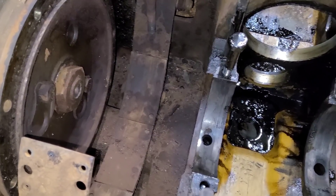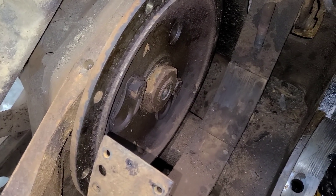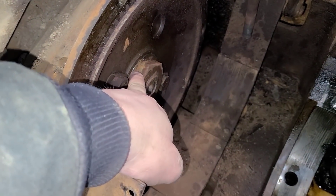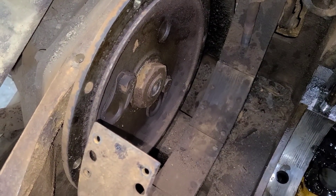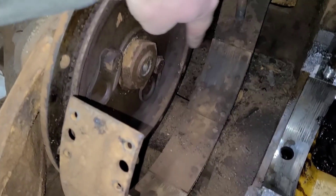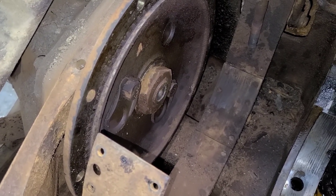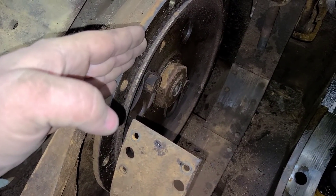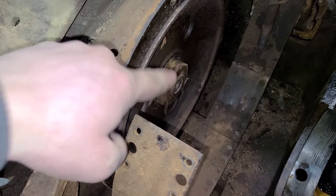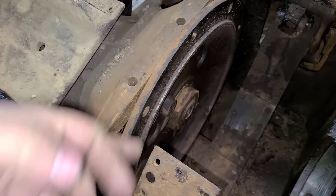Moving on from the oil here. I think what we're going to try and do next is see if these flanges want to be pulled off of there or not. To start, there is a fold-over lock there which I already have folded flat. We'll see if this big nut wants to get backed off. Then you're supposed to be able to take these two bolts out of these covers and insert two bolts, put a puller in there, and see if it wants to move. Otherwise, there is a way to remove the entire works as an assembly — the flange and the pinion gear for your bull gear, your final drive. You can actually drive the whole works in. We'll see if these want to move and go from there.